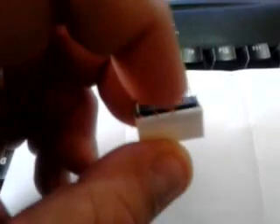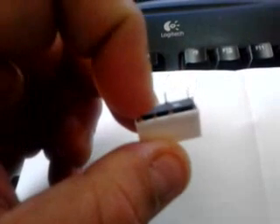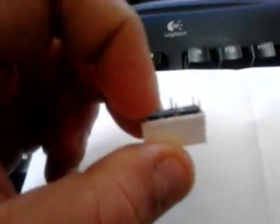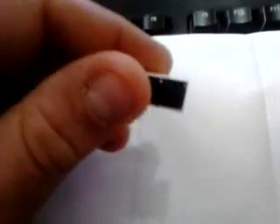These two pins here will close the circuit. Never mind the middle one — the middle one is if you want to switch to one side or the other; you can do two circuits, one on each side. But you only want one, so it closes between this one and this one. Usually, with no power, it's closed between the middle one and this one, but when you apply power it closes between the middle one and the other one. That's basically how a relay works — all shapes and sizes, but the same basic principle.